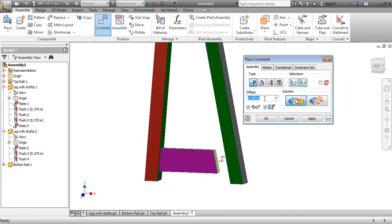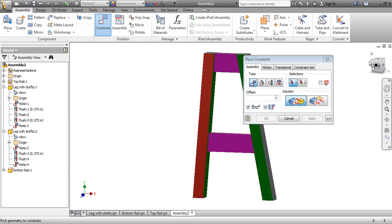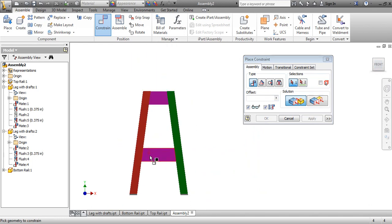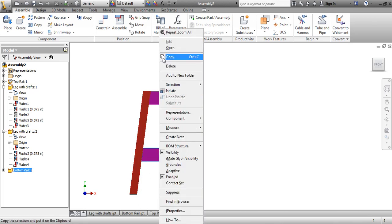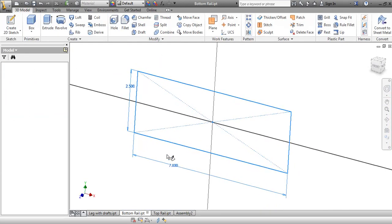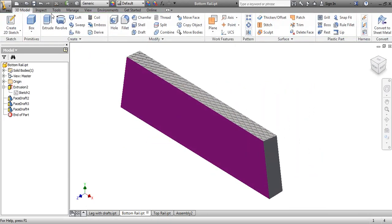The last and neat constraint is I apply this one to this one — as soon as I put 0 here, it automatically snaps right to the top. Going to the front view, I'm not sure that's the right location — I think the rail is a bit wide still. To fix that, I'll right-click and open up the part, go back to the original sketch, and change the dimension — let's put it to 8.5. Click OK, finish it, and save the file.